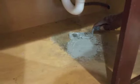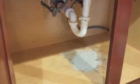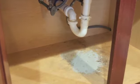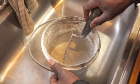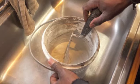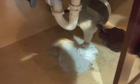One thing to keep in mind in working with plaster of Paris is that it dries very quickly. Do not mix more plaster of Paris than you can work with in 5 minutes. The second application of plaster of Paris will be more of a soupy consistency. You want to be able to level your surface and you need to be able to move the product around.